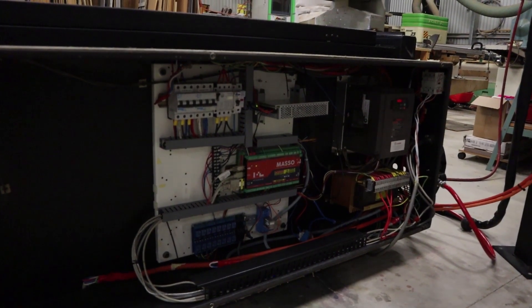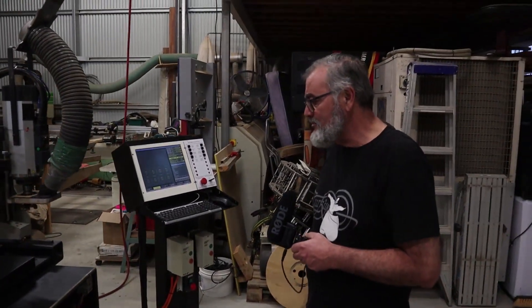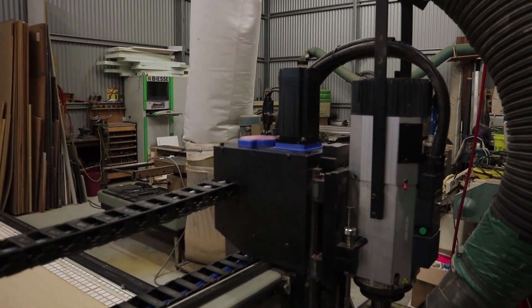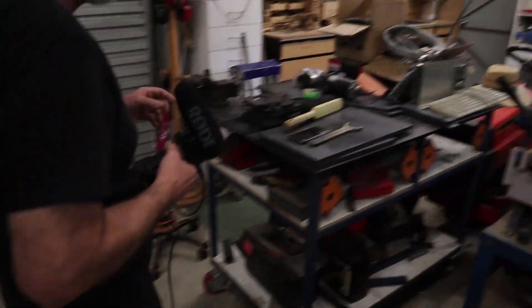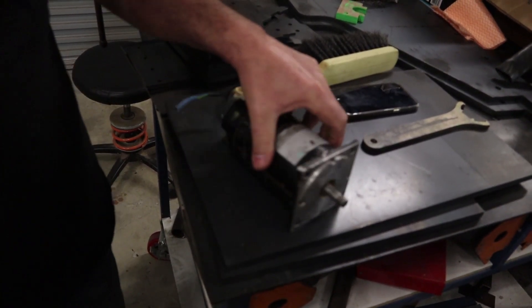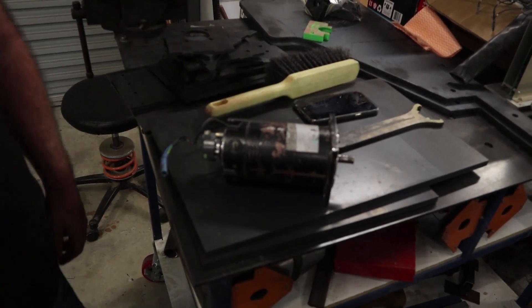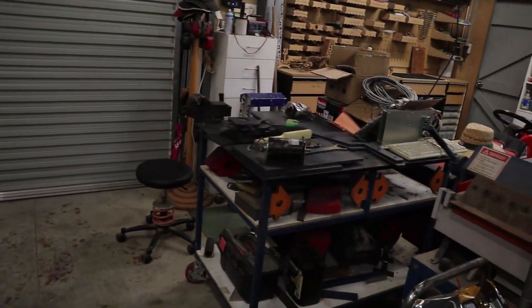I am going to get a 24 volt I/O board from China at some point, but at the moment I just didn't have one. As you can see up here, these couple of blue things — I 3D printed those parts. I had to modify a couple of shafts on the motors and pulleys to make everything fit, because they weren't the same as the original motors. That's one of the original motors over there — an old brushed DC servo motor. The hybrid stepper motors are much more reliable, very strong and powerful. The 12 newton metre ones are probably more powerful than I need — I believe the original motors were only about four newton metre.